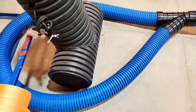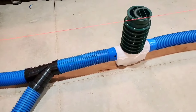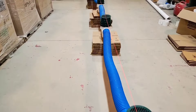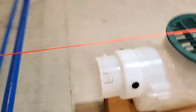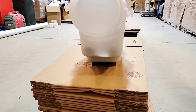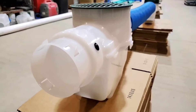A lot of times contractors like to take a hole saw and put a hole in here — that's fine, but we're trying to make this DIY friendly. We came up with a kit that's super easy. There are nine inline sediment traps. As you're taking a trencher and making a trench, you'll have a nice straight trench — these are only 5 inches wide so they fit in a trench made by a trencher. You can see 5 inches wide and it tapers. Just go ahead and drop that in, or it doesn't have to be straight, especially with corrugated pipe — you can go from one low spot to the next, and as you add basins, you just add a spacer.